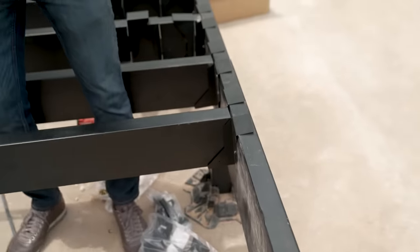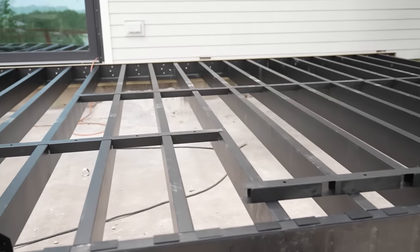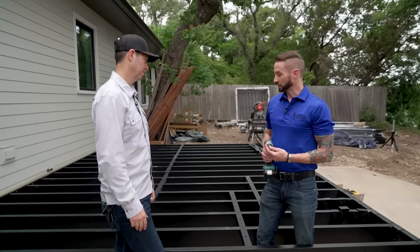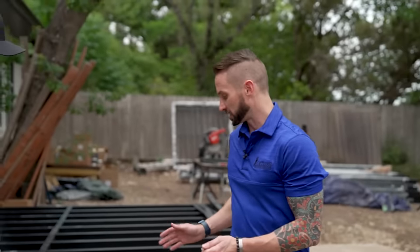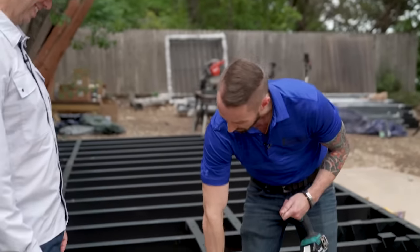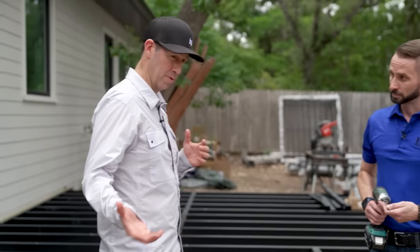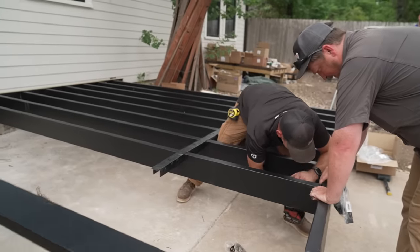We're framing this 12 inches on center, but the system also comes preset for 16 inches on center, which saves installation time. AJ explains that 12-inch spacing is important when using synthetic or composite/PVC decking — in the Texas heat those boards can get a spaghetti look at 16 inches. With steel framing they stay perfectly straight, and it feels much more solid underfoot with no bouncy effect. For this project, going 12-inch on center meant about eight extra joists and a $700 difference on this roughly 20x24-foot deck.